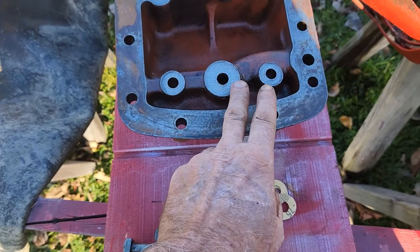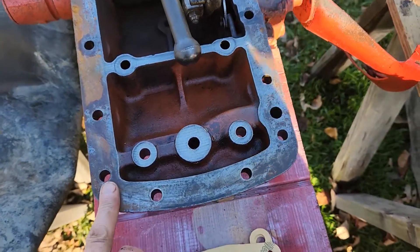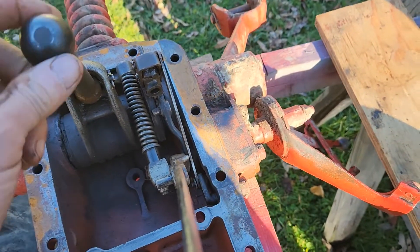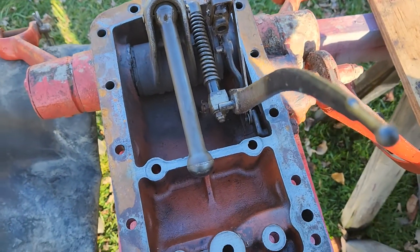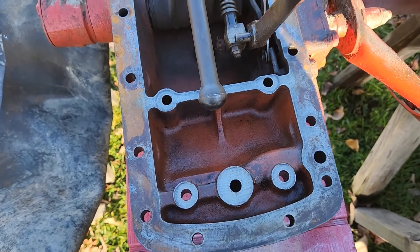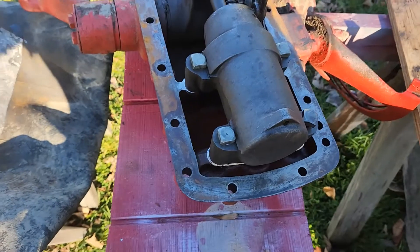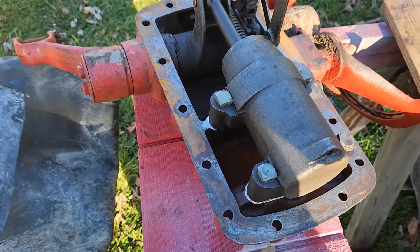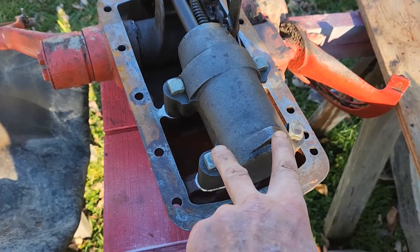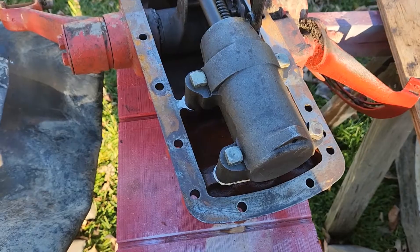Now I'm going to put the gaskets on for the piston cylinder. I won't be able to put the top back on until I get the spring that was broke — hopefully that will be here in a day or two. Get some gasket material on this, put these gaskets on, and mount the cylinder. The two short bolts go in front, the two long bolts go in back. All I need to do is flip it over and tighten the nuts.